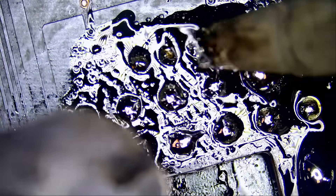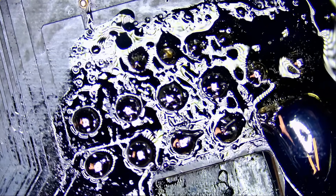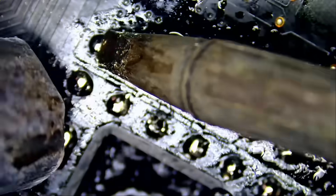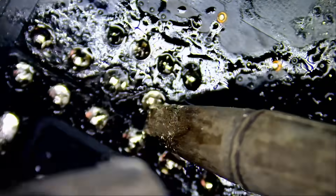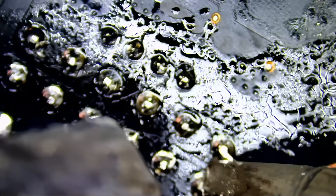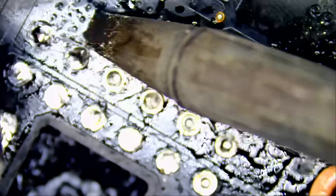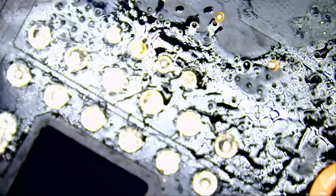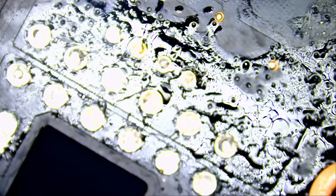Okay, hot air and we're going to push down on the connector. I need to extend the board beyond my bench so the connector can fall down when I press on it. And that connector just fell off the board.